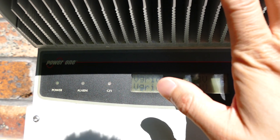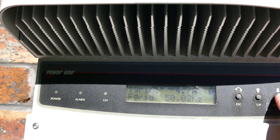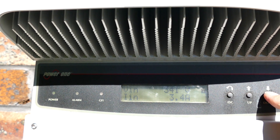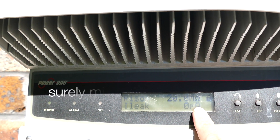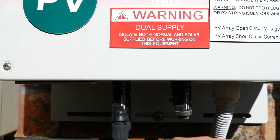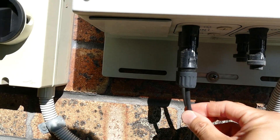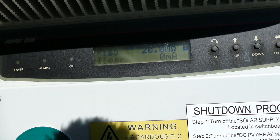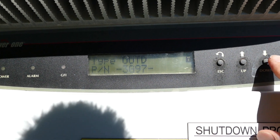It is quite hot actually, just touching it. I probably should have done this many years ago. I'll show you the one thing that impressed my installer — look, 50 hertz, cycling with the grid it looks like, and 340 volts. There's also a reading showing 20 mega-ohms, so that's resistance. He then pointed to this cable here which I'll show you — he was impressed with this cable, still in good shape. So it looks like my inverter system is still pretty good after six years, even out of warranty — I'm pretty happy with that. We'll get a new inverter with the new system obviously.